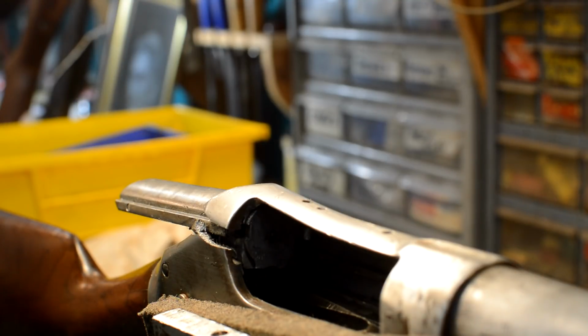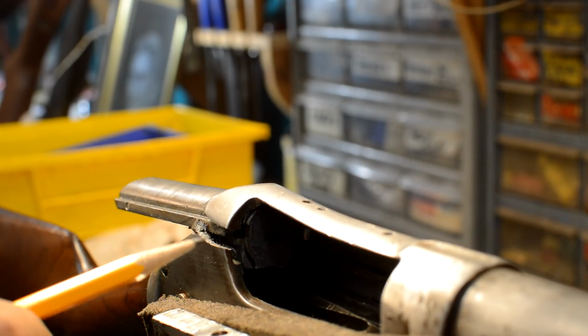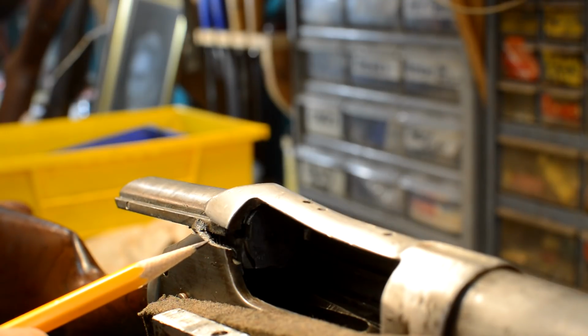It was fired below the metal's reference transition temperature. You nukes know what I'm talking about. So it failed brittly, not ductilely. This thing did not come apart like a piece of chewing gum. It came apart, it shattered like a piece of glass.